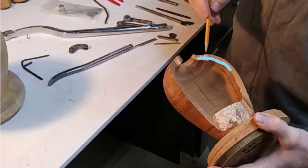It's very quick. But I think I had the larger gooseneck bar, which means that I didn't have a lot of clearance here. And I probably did not have the tool rest in the proper position. I probably had the tool rest in the curved part rather than on the straight part. And those two things combined to cause me to have this piece fail.